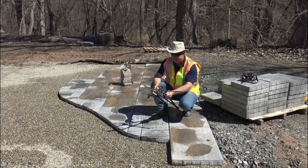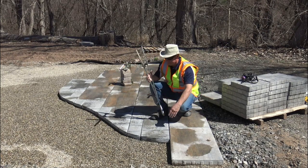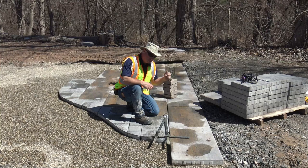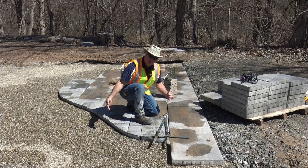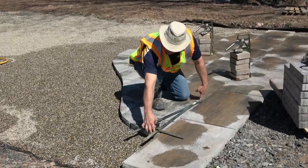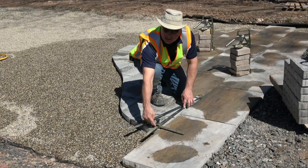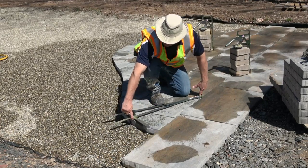For instance, if I'm doing a fire pit — I did the same thing here on this radius cut on this job — I was able to mark it. Generally I would keep a grade stake; we made this with a grade stake opening. So if I had a grade stake in the ground and I knew I needed a 36-inch radius off my patio, I'd put my grade stake in the ground and then I'd be able to set my length. That was 36 inches. I'm using a 6-inch border, so I've come back to 30 — I've got this unit set at 30 inches. I can set it here and run my radius.